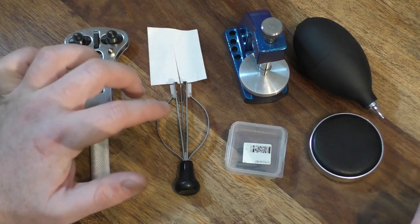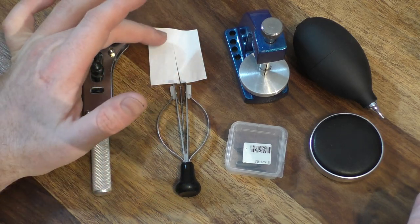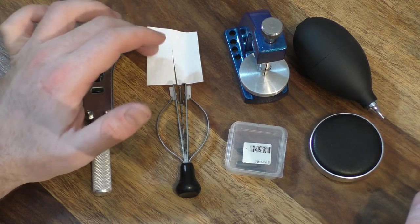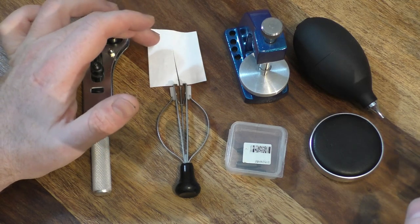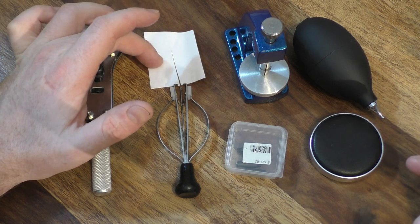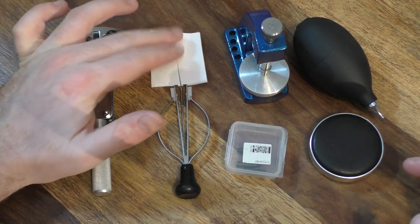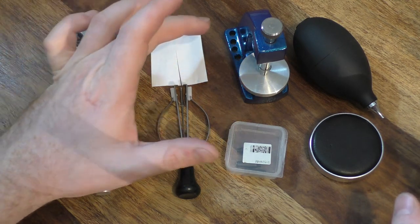Second, a hand removal tool. I've got a cheap two or three pound one here — used it for years, never had an issue. I've also got a bit of paper with a cutout, basically to protect the dial. You put this under the hands before you actually put the tool on. You can get an expensive watchmaker's version from various companies, however I don't see the point — this is thick quality paper and I've never marked a dial yet using this method. It's the cheapest and best option in my mind.